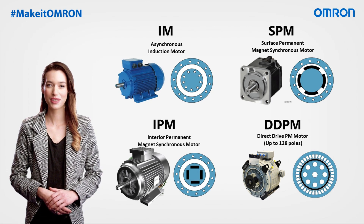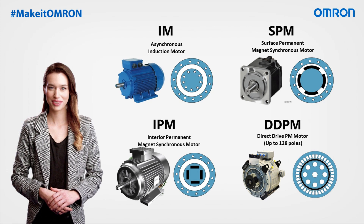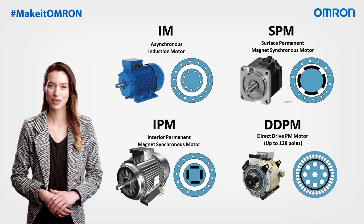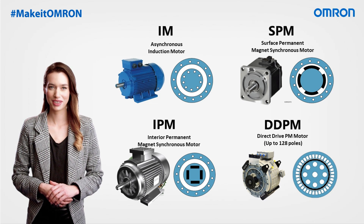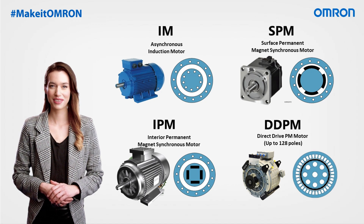The M1 presents four load-duty models, enabling precise energy optimization tailored to the connected motor type. This optimization is further enhanced by employing Omron's cutting-edge auto-tuning algorithms, which can reduce power consumption by up to 20% without the need for manual adjustments. Additionally, the M1 Series offers the flexibility to integrate regenerative solutions, giving you the power to develop more dependable and energy-efficient machinery.